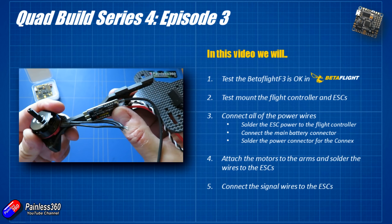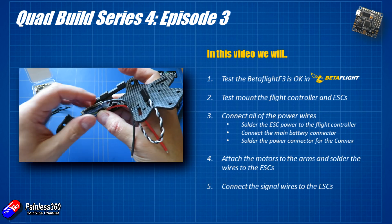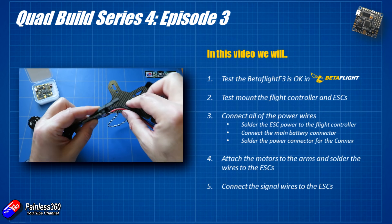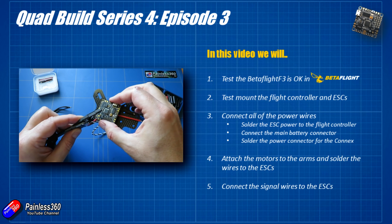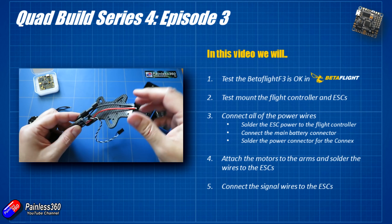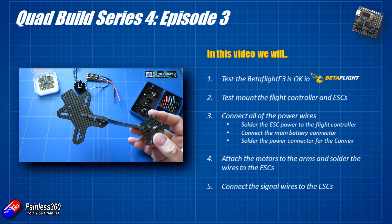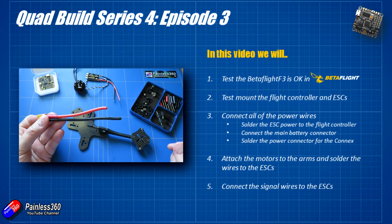We'll make off the motors onto the ESCs, keeping that vertical profile as thin as possible. The ESCs are going to have to connect into the flight controller — not only the signal wires on top but the power wires at the bottom. I'm probably going to have to mount the flight controller temporarily first and then clip each of these wires just so I know how long they need to be, then solder everything up.